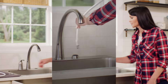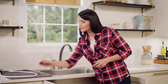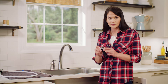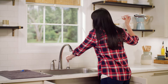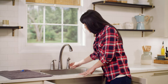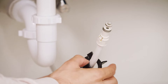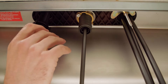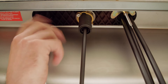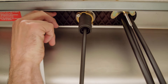Now we'll move on to installing the veggie sprayer. The veggie sprayer comes with a support assembly and a trim ring. Put the support assembly in the trim ring, seat it in the mounting hole, then feed the veggie sprayer down. From under the sink, use the plastic mounting nut — feed the hose through the center of the nut, then run the nut up onto the bottom of the sprayer shank to secure it to the deck. The plastic nut should thread on pretty easy, so don't force it. Spin it all the way up snug to the bottom of the stabilization plate and tighten it down.